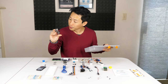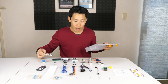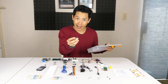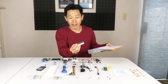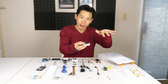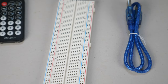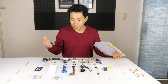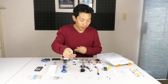On this Arduino you have 13 or 14 IOs and six analog ins, and you'll want some for PWM, so seven-segment displays are a big wastage of IOs. You'd rather use the LCD, but sometimes you want the retro look. To drive four digits you'd need 7 plus 4 multiplexed IOs — 11 total. The included remote I already talked about. There's a little breadboard, which is great for prototyping, though it's sometimes nicer to have things more permanent.